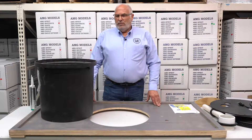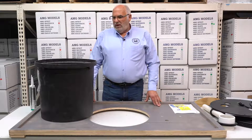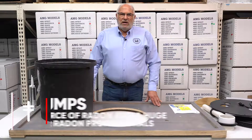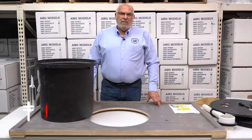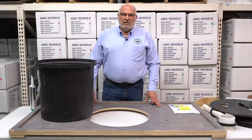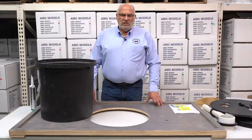We're going to talk about sumps. First of all, sumps are a huge source of radon in a home. They must be sealed in order to properly do a radon system. And above and beyond that, they're also your largest liability, because when you start sealing that sump, you're messing with the ability to flood a basement. So it's important that you know a lot about sumps, and to further complicate things, each and every home is different. So teaching people how to seal a sump is a very difficult job, simply because each and every home has a different scenario that you have to deal with.